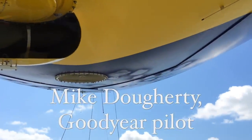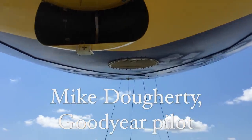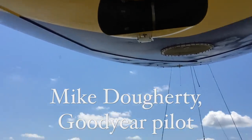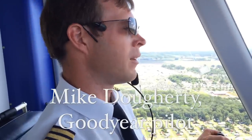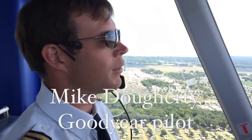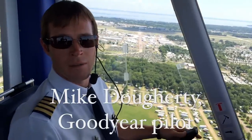So the nose of the Zeppelin that we're looking at right up there — what is that constructed of? What you see here is the envelope portion. The envelope is a Tedlar-coated polyester fabric with a polyurethane bonding agent. We have it painted, so everything that's yellow and blue is a specially developed paint — it's also a helium retardant paint. The Tedlar is also a helium barrier and a UV barrier for protection from the outside elements.